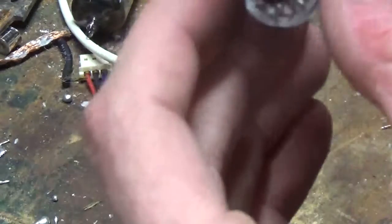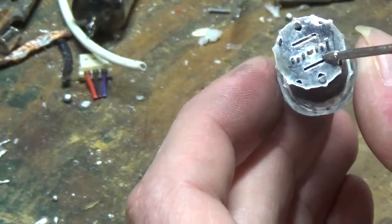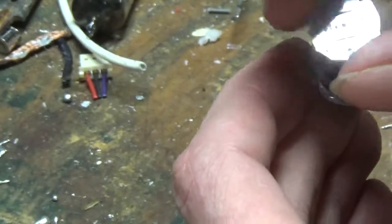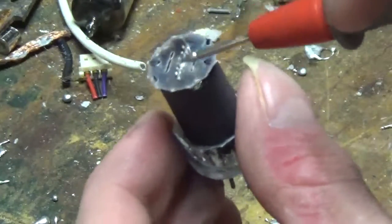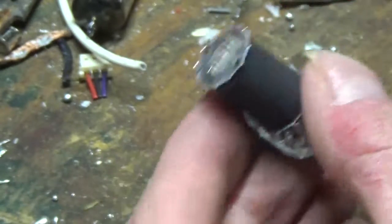This here, this is a mica insulating sheet here. It does two jobs. It not only insulates from current flow in certain directions, but it also acts like a brace up against the envelope, which would be the glass bulb part. It also acts as a structure to hold all the components. There should be two of these, one on either side. They're made out of mica crystal.